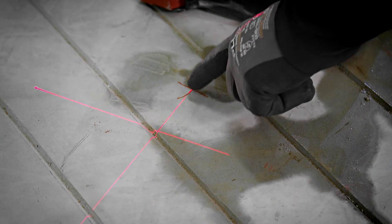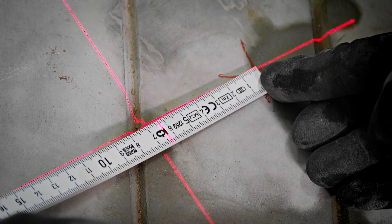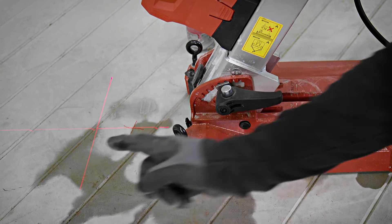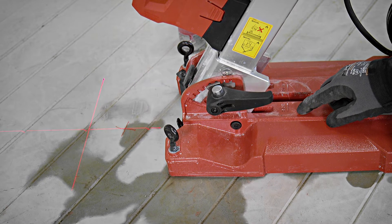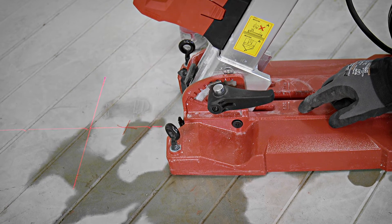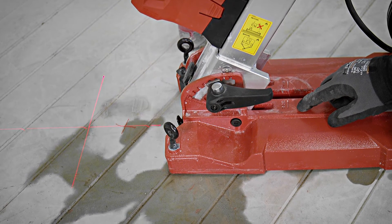The deviation at 30 degrees is the distance between this cross and this cross. In our case, that is 65 millimeters. 65 plus 292 is 357, so the new anchor distance is 357 millimeters.